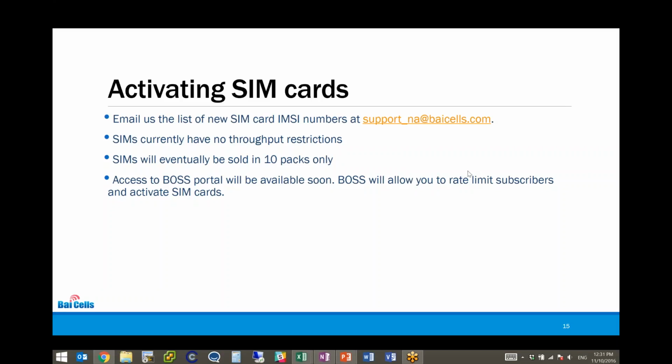Yep. I'll just answer one more and then we'll go on. But John, you had one about the PCI locks on the UEs. Actually there's a bug with the UE. If you change the subframe, sometimes they need to be power cycled. So that's actually a known issue internally. With a CPE update, that will fix that issue.